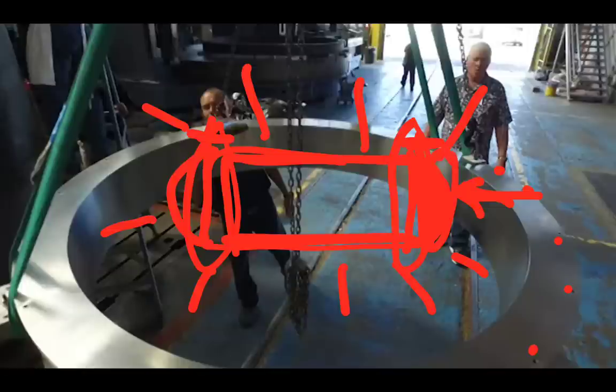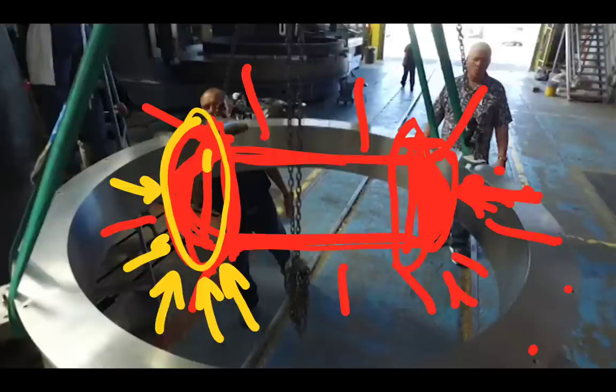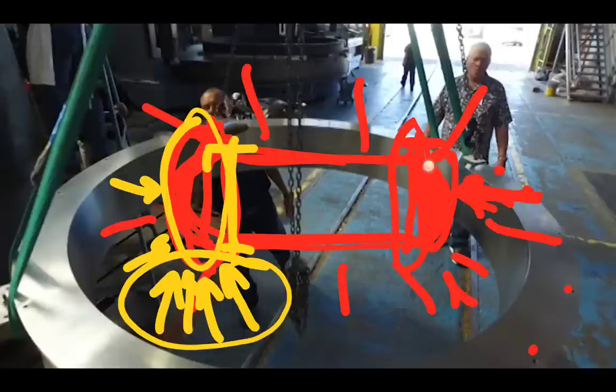At some point the door is so heavy that it's not just pressure keeping it pressed to the tube — it's the bolt connection or however the door is sealed: interlocking, hinged, etc. That's what keeps it together until the pressure is so great that you couldn't slide this section down even if you wanted to. A thousand-pound door can't move against tens of thousands of pounds of pressure outside. The bolts keep it in place until you reach that pressure threshold that automatically locks the door.